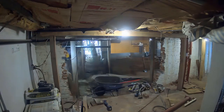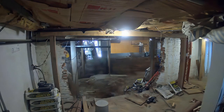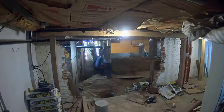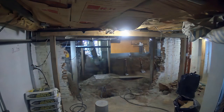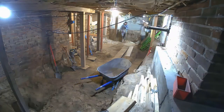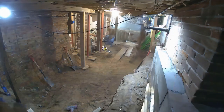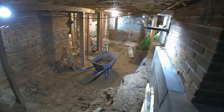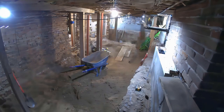Jumping into the time-lapse — pretty standard week. The guys were doing a lot of digging getting that floor down as well as all the footer work. Right away you can see them demoing that center wall, getting it out of their way and opening up more room. The key to these basement digouts is just having enough room so you can move guys around and move equipment around, as well as having paths for the wheelbarrows — that increases the efficiency.